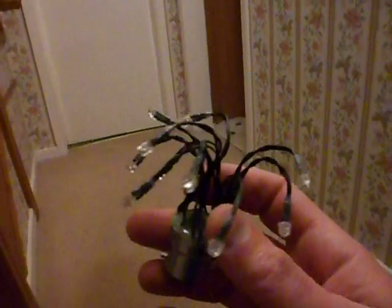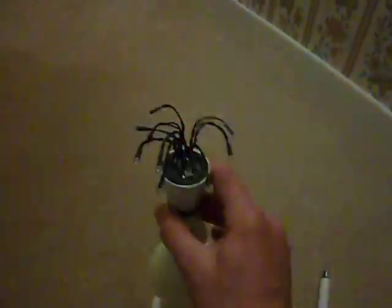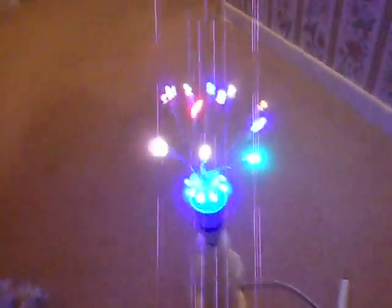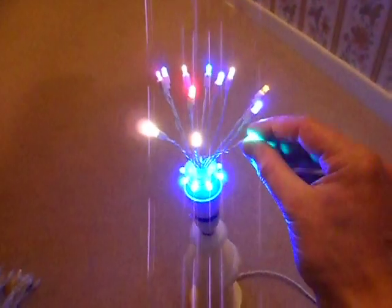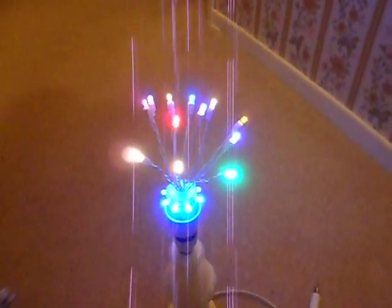On the subject of lights, this was an experimental lamp — I thought I'd make it a little ornamental lamp, quite small. It's got about 12 LEDs in it with a little capacitive dropper, I think based on 100 nanofarad again. It's just a wee scattering of LEDs — quite nice, quite attractive. I thought: what if I put little Molex connectors on the end so you could plug LEDs into it? I made another one with lights around the side as well. It's a wee bit ferocious — you'll see a slight pattern in the camera probably because these are running on unsmoothed DC output, so there's a bit of flicker, but it's not visible to the human eye. You can just pull these LEDs out and change them, although it's not recommended while the power's on because it's mains-driven and you could theoretically get a shock.